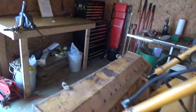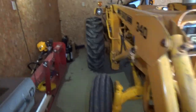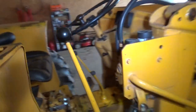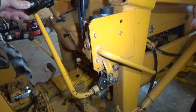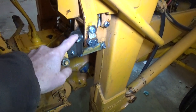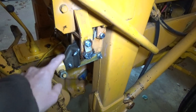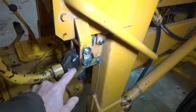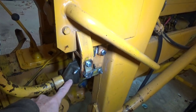The next thing to check is the joystick for the hydraulic on the front end. The arm for this hydraulic is really, really heavy and they didn't put any grease fittings in here, so it wore out almost immediately and you can't get them anymore. I paid $220 for this one, drilled and tapped and put two grease fittings in it, then had to make a new pin for it. This is usually one of the first things to go.